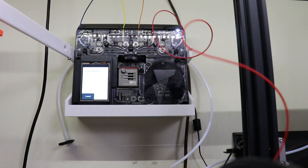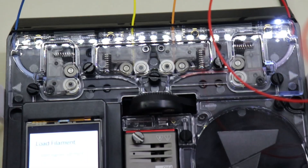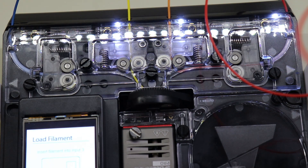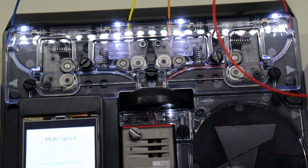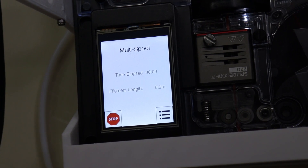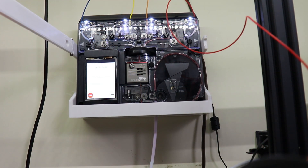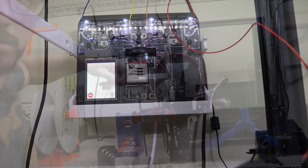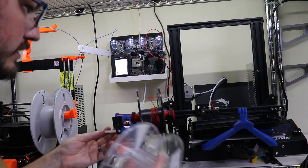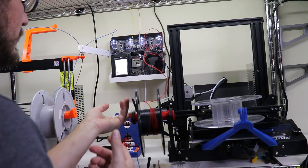You can see it pulling each of these in as I give it a little nudge to push it in — number three and number four. Now it's starting the multi spool and it's going to count how long my filament is, which is pretty cool. It pushes it up and around through the buffer chamber and is now pushing the filament out. It's taking all of roll one in until the end. Once it starts coming out of the Bowden tube I'll get my other spool ready and start spooling it. This is going pretty quick — we've already got a meter of filament created.